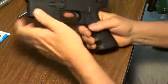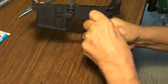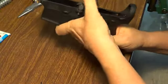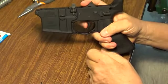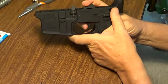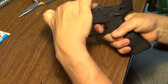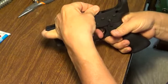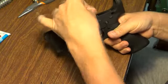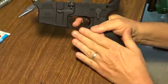At that point, the pistol grip is on. When the hammer is forward, you should not be able to move the safety selector. With the hammer back, you should be able to move the safety selector to the safe position. When you do and pull the trigger, obviously nothing should happen. Move the safety selector back to fire, hold the hammer, and it should fire. That's the basic function test for the whole trigger group with the safety mechanism.